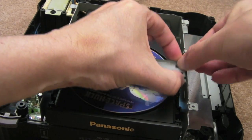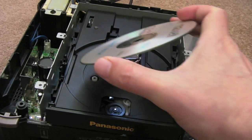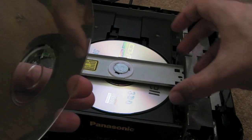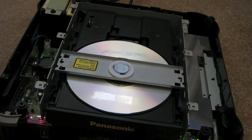It's a bit like night and day — when it's not working, it doesn't work at all and just will not read the disc whatsoever. But that tiny, tiny adjustment there makes all the difference. The spindle height is obviously critical as well; I've had to play around with the spindle height a little bit here — trial and error again. If you've got a scope and the service manual, obviously you could dial it in perfectly.